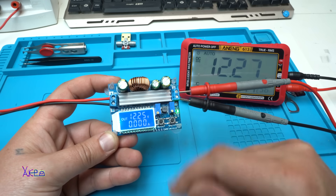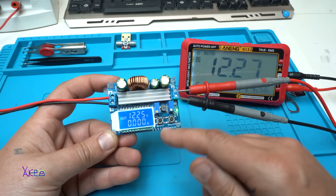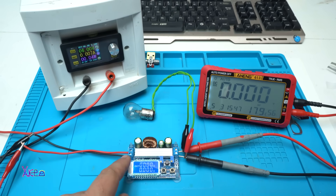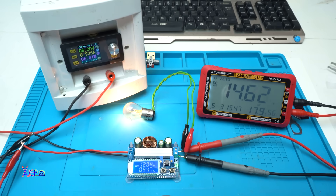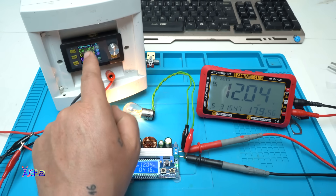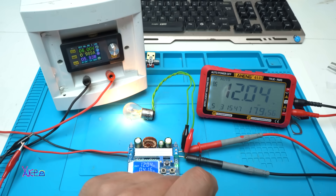Now I will attach a light bulb as a test load so I can see the amperes. My power supply is giving 6 volts, connected to the DC converter boosting to 12 volts, and monitoring the voltage on the multimeter and also on this tiny LCD display. It shows 6 volts input. Turning on the light: it's pulling 400 milliamps, the output voltage is 12 volts stable, and from the power supply it's pulling almost one ampere.